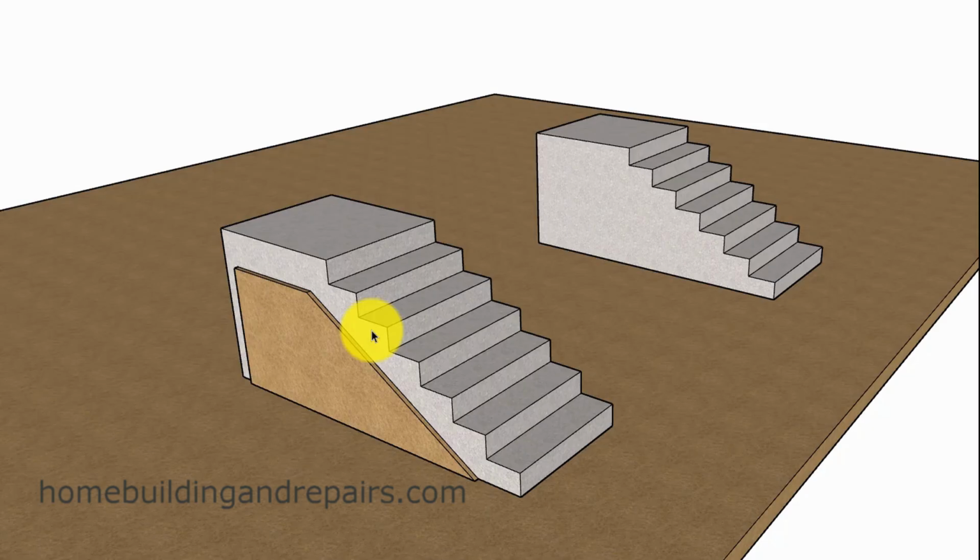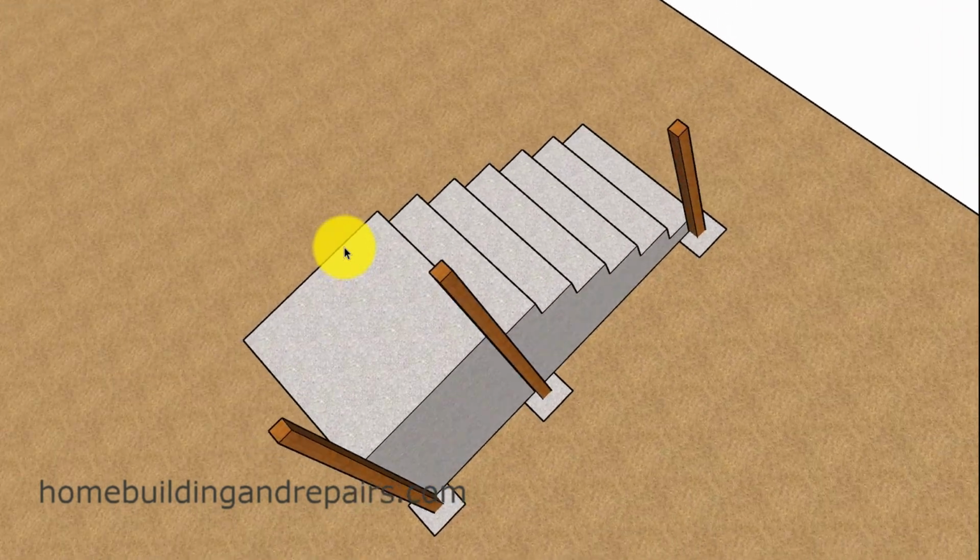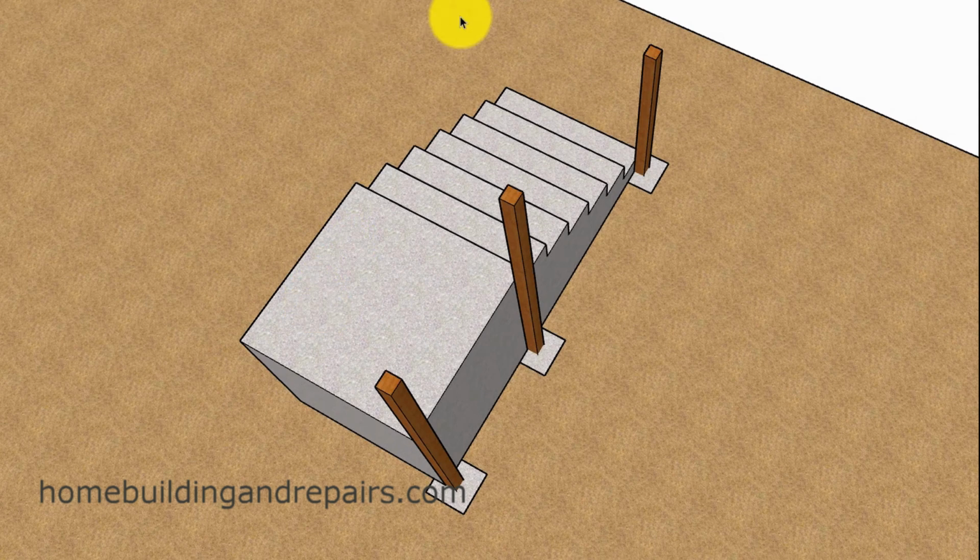Now, for those of you who have watched enough of my videos, I try to provide you with a few alternatives, and this is just going to be one of them. If you have a concrete stairway that is sitting on top of soil, your front yard, your lawn, grass, you can actually dig a few holes and install posts in the same way that you would for a fence post. And I'm going to go ahead and put a link in here also for that, to give you some more ideas on better ways to pour a post like this and make it last a little longer, hopefully.